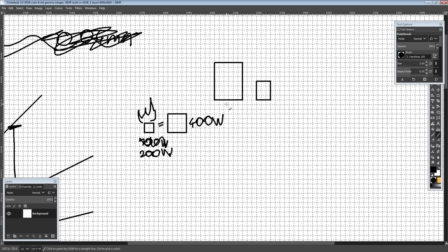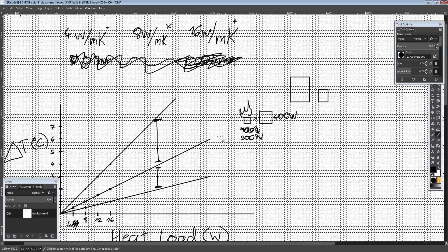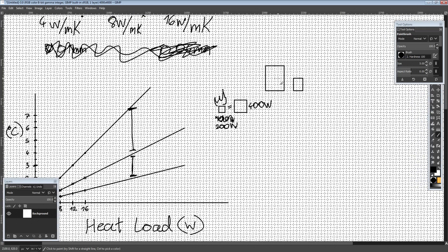This means that if you're testing thermal paste on top of an IHS, the difference between pastes will look significantly smaller than if you use the paste under the IHS. Heat sinks don't suffer from the same surface area issue quite as much — they're more about absolute heat output rather than thermal density.